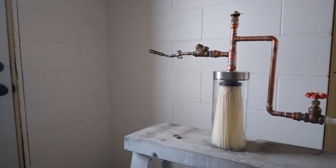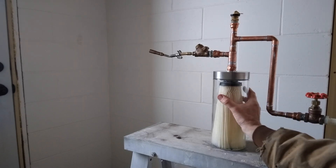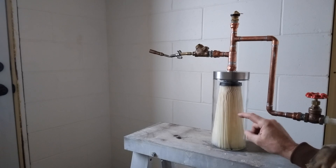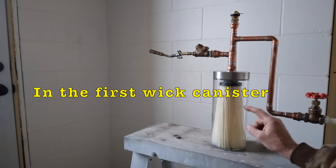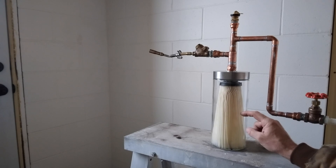Definitely a lot more vapors being generated, but I don't think I need the wick to be that tall. I can see that I definitely need to add some hot air blowing through here instead of cold air. This was fresh fuel and it does burn better. The last time I burned it when the paper was dry, the heaviest molecules of gas were left, but they did seem to all evaporate out and burn.